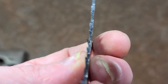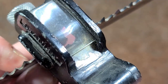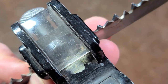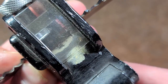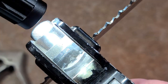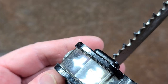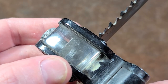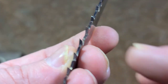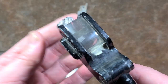Get it centered up and then squeeze — and now you can see we've pushed that tooth over. For the one next to it, if I want to bend that one I need to flip the blade over and figure out where I'm at, which is not easy inside here. I see why they have the magnifying lens — surprisingly hard to see. But under a real bright light you just line up each tooth and give it a nice squeeze, and we've now bent the second tooth the other way.